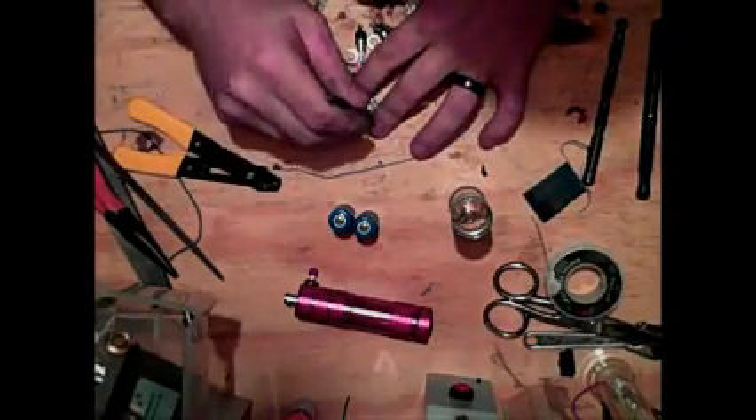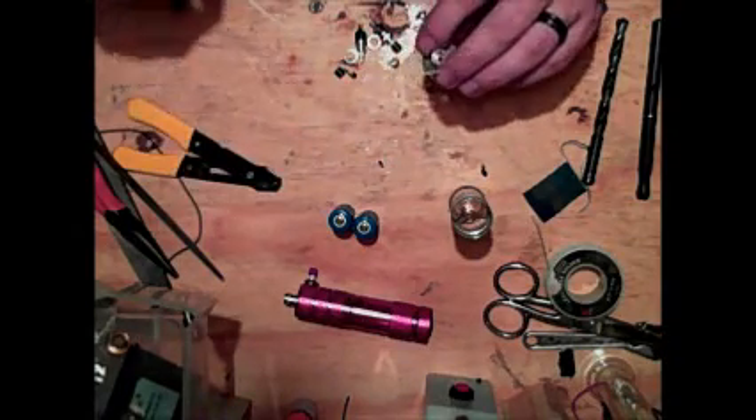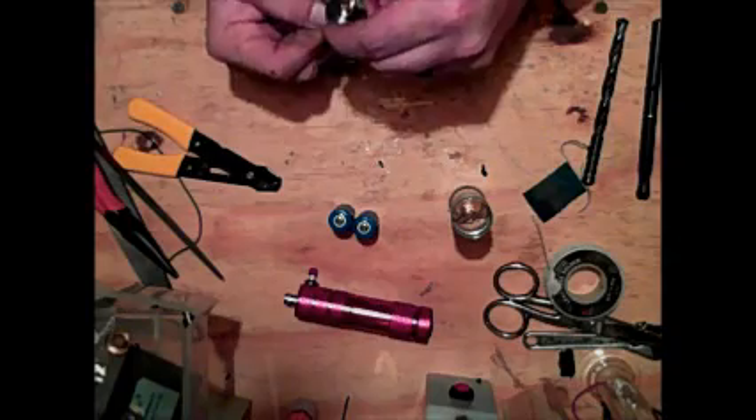When I braze this into the back side it does look kind of disgusting, but when I literally braze the connector into the washer there's solder that fills it up all the way around so it's not going anywhere. I removed the center silicone piece and to get that back in there I found you take a quarter-inch drill bit, press and twist, do it a couple of times — it's in there nice and nice. You'll then pass your wire through like so. Now you have a seated 510 connector.